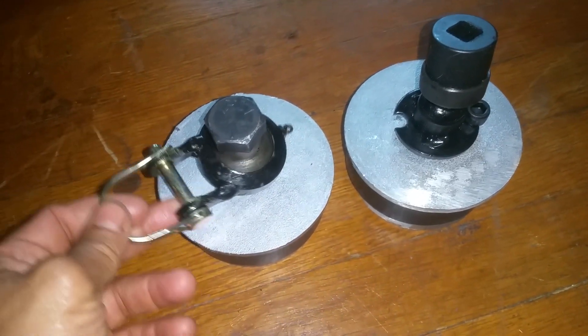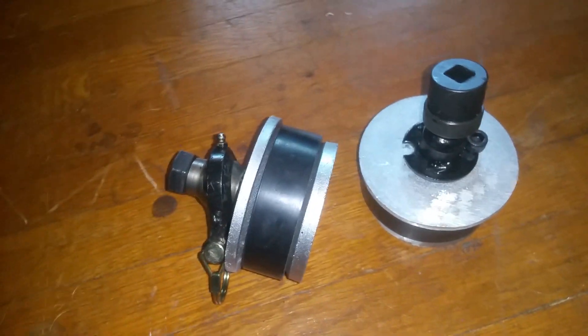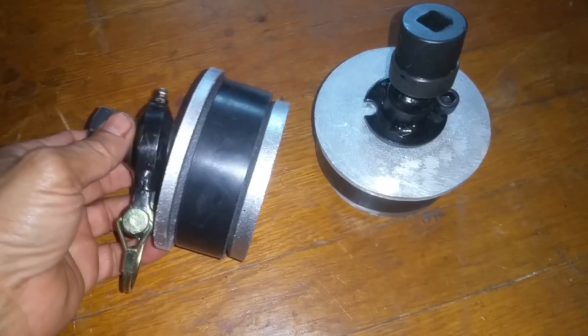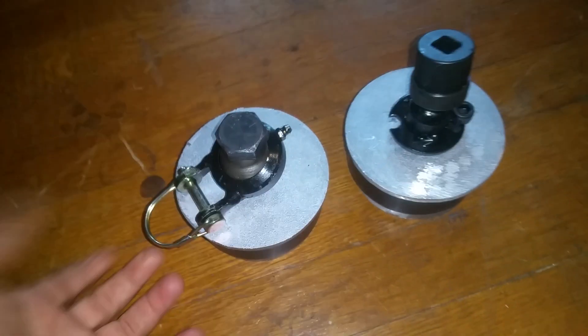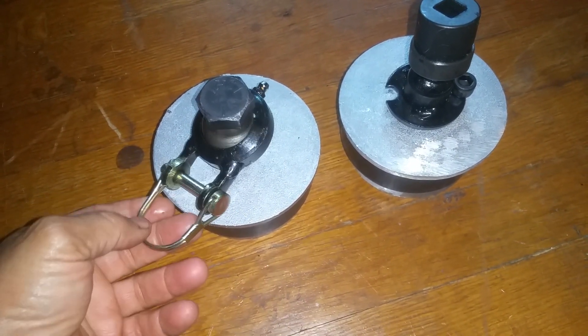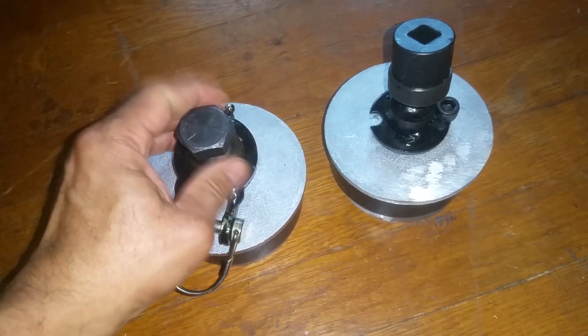I do recommend calling direct. The concrete roller screed is composed of these two ends with a 4-inch seamless aluminum pipe. Seamless because you can imagine if it was a seam pipe, you would create every one revolution a little whip in your concrete, a little defect in your concrete.